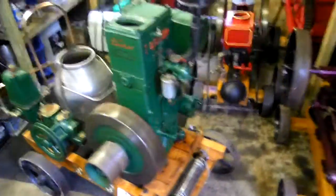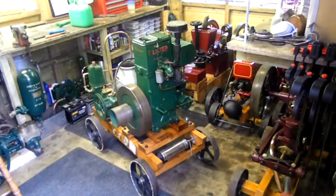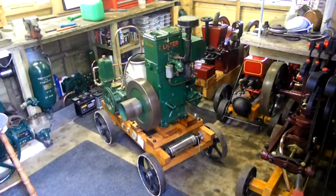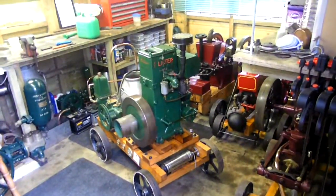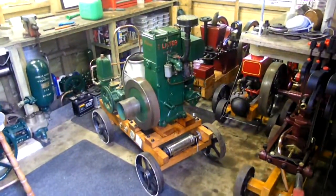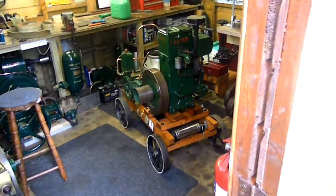The pump I took back to bare metal. The only reason I took the engine back to bare metal is where it's got bigger flat areas and you can see it more. The pump doesn't get so worn, you know what I mean — the engine gets petrol, oil, heat and everything, so it might as well have been done properly. The fuel tank I had to do again. That's the stationary engine paint — the paint for the actual engine is alright, it takes the heat and oil and stuff, but it won't take the petrol, it's not any good for petrol-proofing. So I'll do the tank again. I'm not doing the whole engine because the whole engine took me about three weeks in the first place back in 2011.